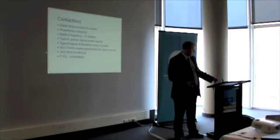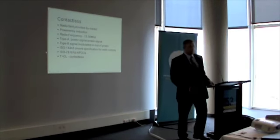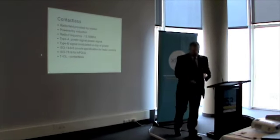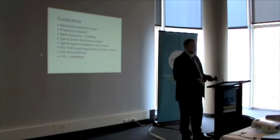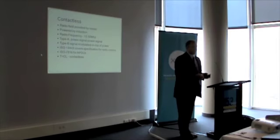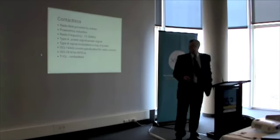The next fun one, and where Snapper really gets into the picture, is when we talk about contactless cards. If you remember the contact card, that's stuck into a reader, and I'll just show you one. That is a reader that, say, you'd find at a car park or a vending machine, where the card slides in, and the contacts match up with little pins inside. So there, that's sliding in. And it does have a latch, so as soon as you put the card in, the machine says, thank you very much, and it latches it down, so you can't pull it out until it's completed its transaction. But the device is providing the power, so that's all nice and easy.